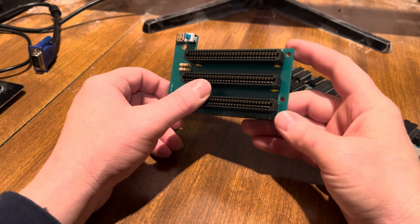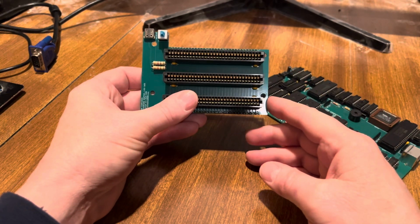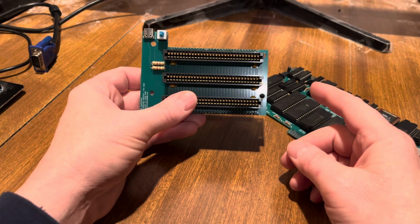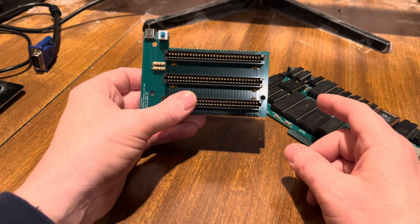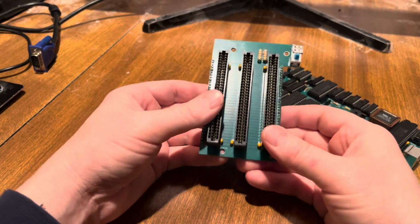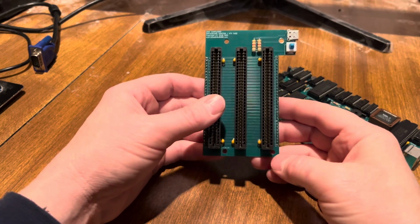I've got the 2 mounting holes here. Now, the regular mounting holes are actually further down on the case, so these holes don't line up with anything. But I did not want to extend and have excess board just for mounting holes. It would kind of defeat the purpose of this being plugged into a breadboard. It would take up too much real estate.